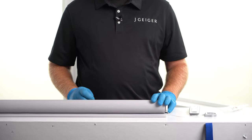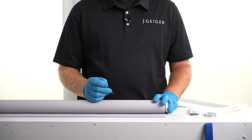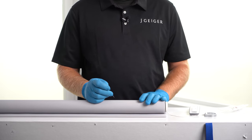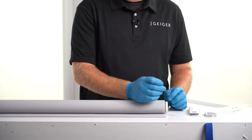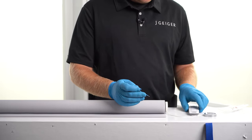The first thing you might need to do is wake up the Somfy remote. This just requires a bunch of presses — I've already woken this one up. But if you find that it's not responding after pressing and holding, just press it four, five, six, seven times in a row until you feel it jog. Once it stops jogging, it'll be woken up.